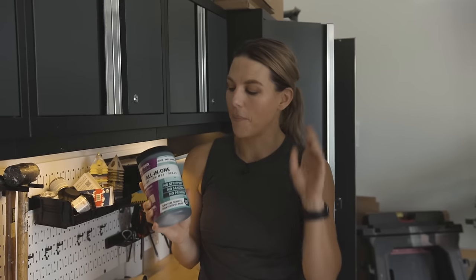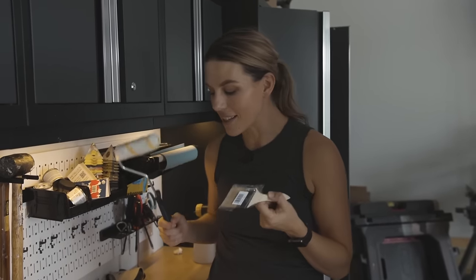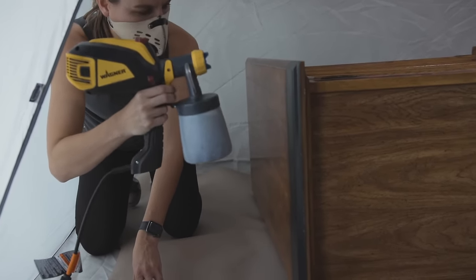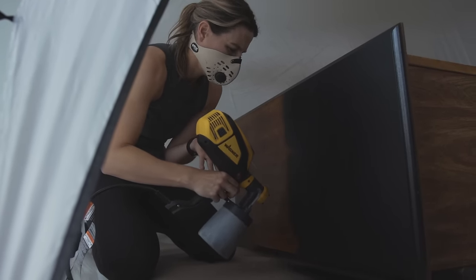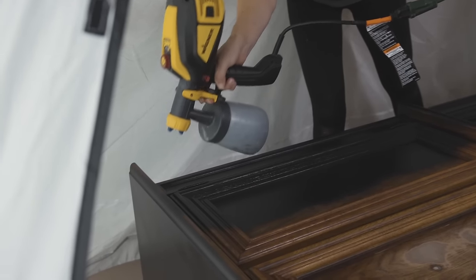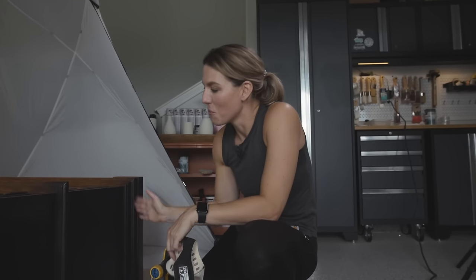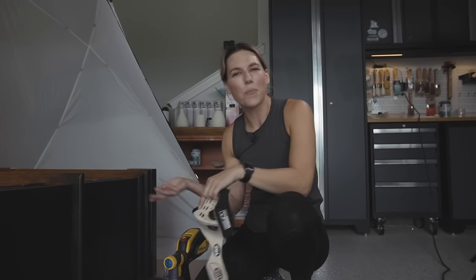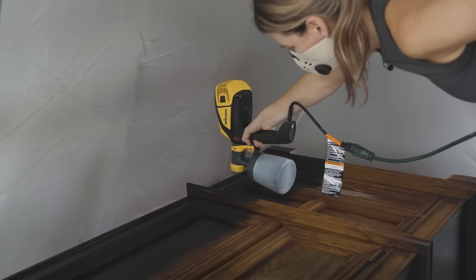We're finally ready to paint after all that prep. If you're not new to my channel, you will definitely recognize this all-in-one Beyond Paint. One of my most popular makeovers was done with this and I love it because it's so beginner friendly. I normally put it on with a roller and chip brush, but I wanted to try to spray this. I've been getting really comfortable with my Wagner sprayer. That definitely went way faster than rolling, but Beyond Paint is textured — it really does have that orange peel effect. That helps it get into the nicks and dings and gives you a better look on a piece that might be a little beat up.